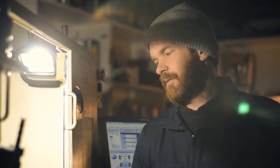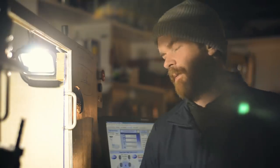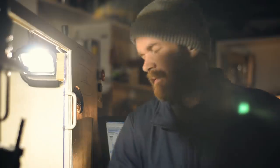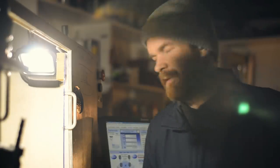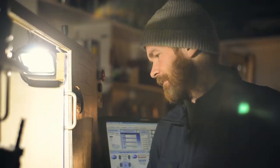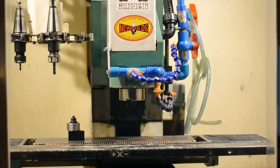Z was 0.1 millimeters off, and X was spot on, Y was maybe 0.1 millimeters off. But we're talking wood here, and I took the dimensions of unfaced and unmachined wood, and I didn't note exactly where I did those measurements, so yeah, inconclusive. I'll have to do another test, like a stress test with a lot of said movement.